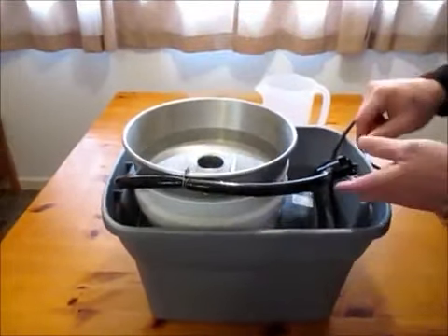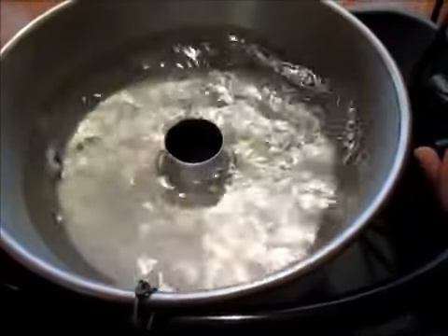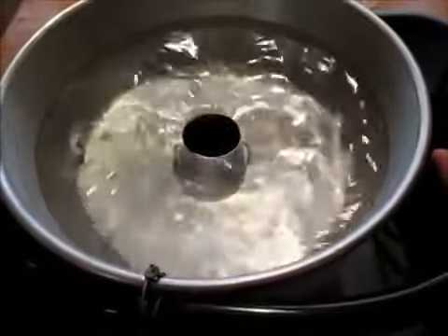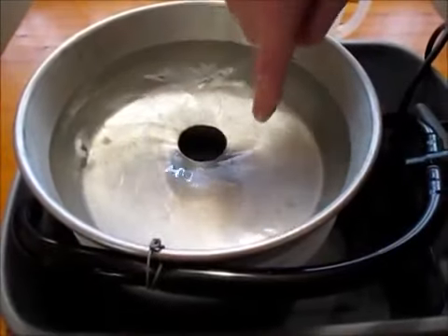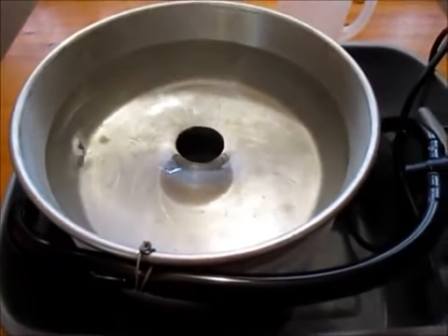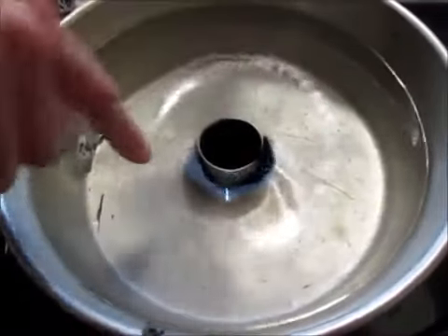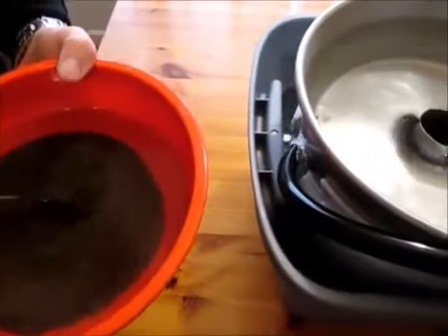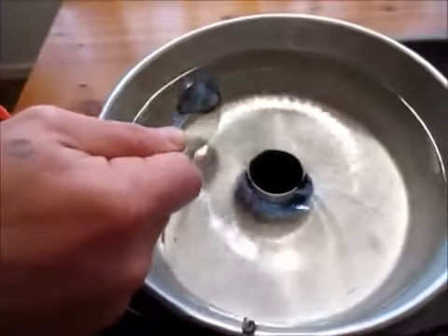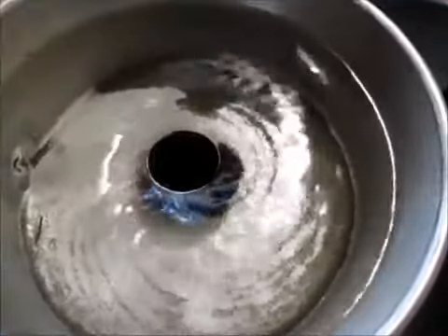Now that it's running, I can see how the water is spinning in a circle. I can adjust my flow with my control valve, and you can see how it creates the vortex. I'm going to turn this down a little bit. You can see how the water is spinning on the inside and just coming up over the top. Now I'm going to go get some material and see what it looks like as it runs. The blue bucket is up to speed — it's creating a nice cyclone and the lighter material is going up over the center. I already classified my material; it's real fine, which helps it run better inside the bucket.